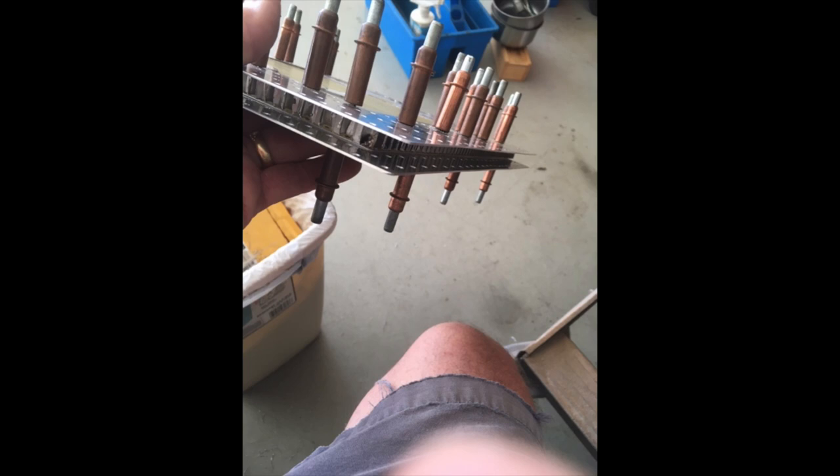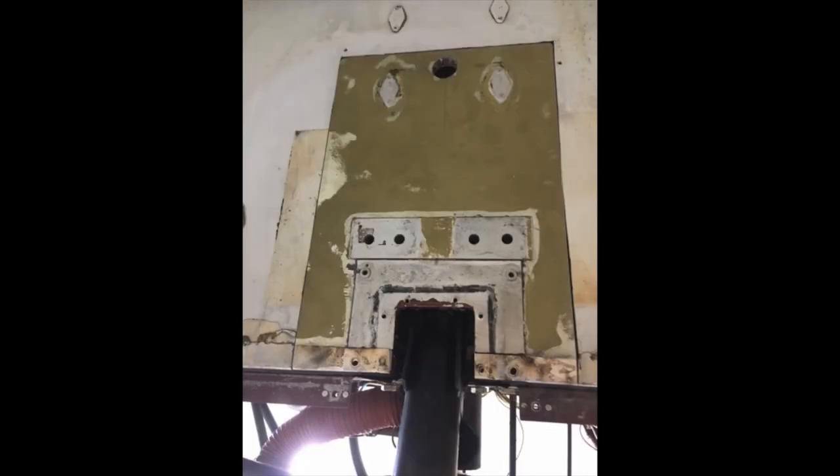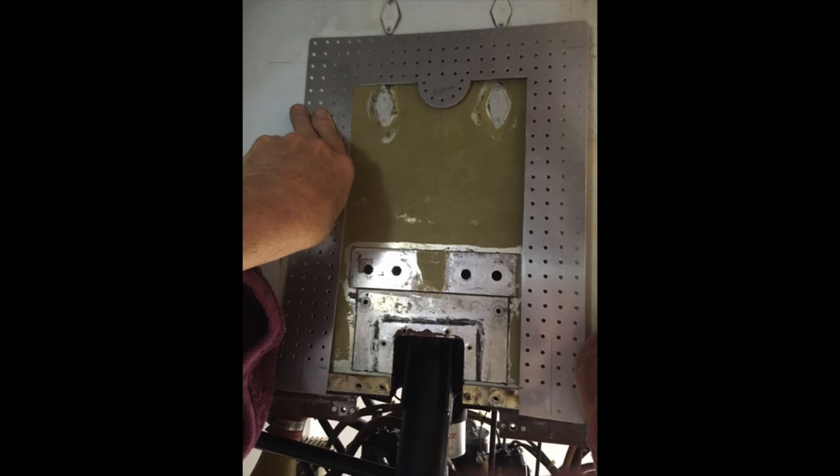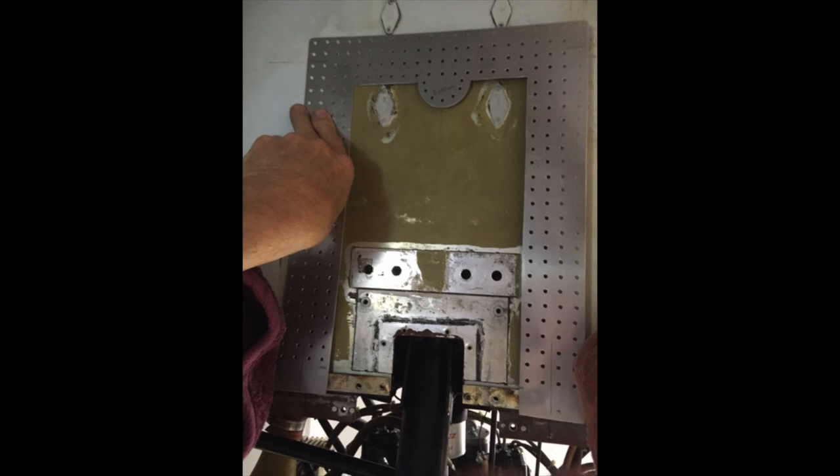There was a lot of drilling that had to be done. Here's another picture from the other side of the airplane checking the fit from the outside — this is good enough to pass muster and conforms to the manual. Now we're going to take our doublers and countersink them; about 500-something rivets are used in this repair process, again making the airplane stronger. We place everything in its proper position and check it for fit.